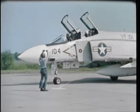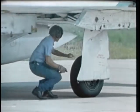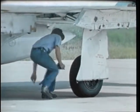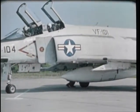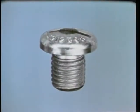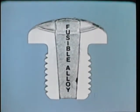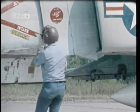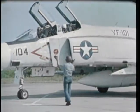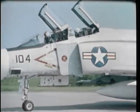Excessive braking, for whatever reason, will generate tremendous heat in seconds. Brake application at a ground speed of 150 knots, bringing the aircraft to a stop in 1,000 feet of runway, causes tremendous energy, which is absorbed by the brakes and could heat the brakes to a cherry red within a short period of time. Some aircraft wheels are equipped with thermal fuse plugs. These are designed to melt at a temperature below the danger level to relieve the air pressure and prevent explosive wheel failure. If your aircraft has excessively hot brakes, your pilot knows he will be directed to taxi into the hot brake area, away from other aircraft, personnel, and the fuel pits.